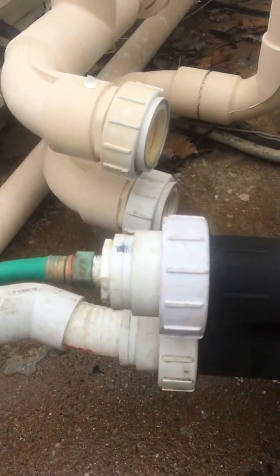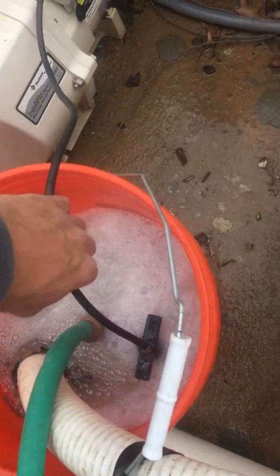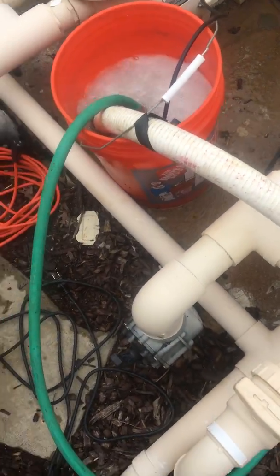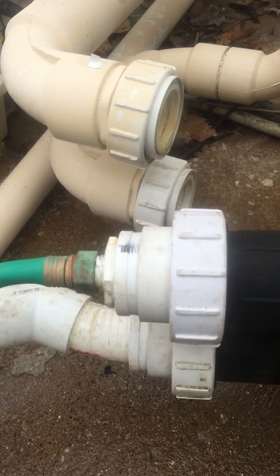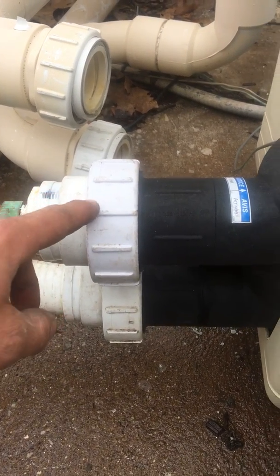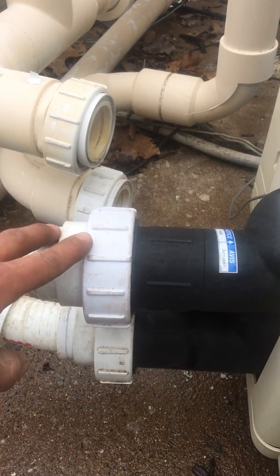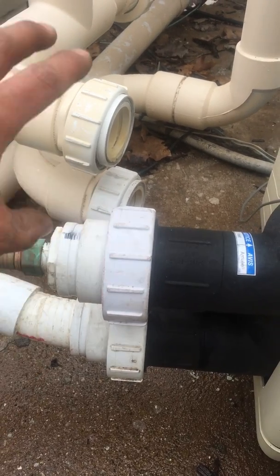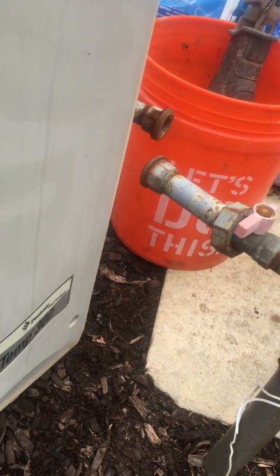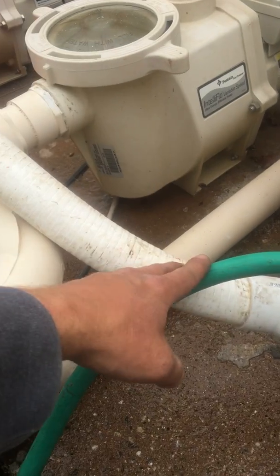Basically I took just a sump pump you'd buy from Home Depot — one of those little guys — and I hooked up a garden hose and a couple couplings. I had bought another pair of MasterTemp couplings. You can also tee into the existing plumbing, but since I do a lot of these and there's not often room for plumbing, I disconnect the heater and also the gas line, which I'll cap, just so I can move the heater a little bit.